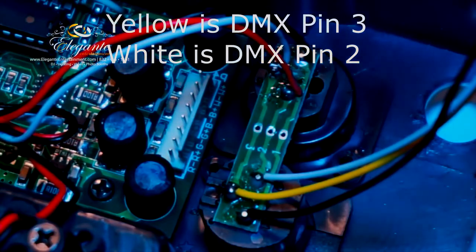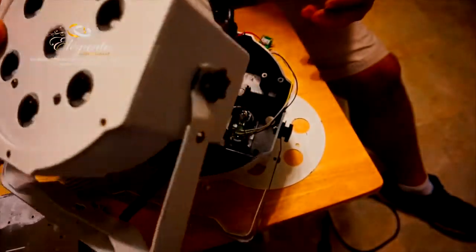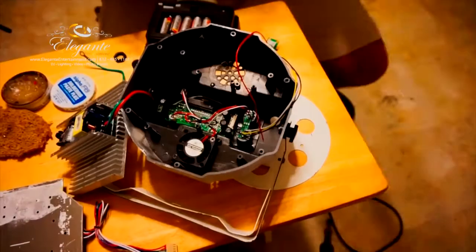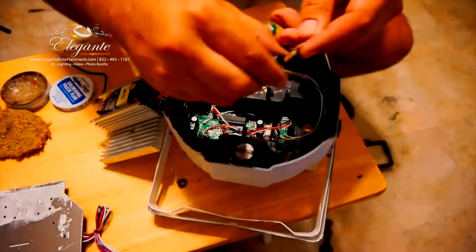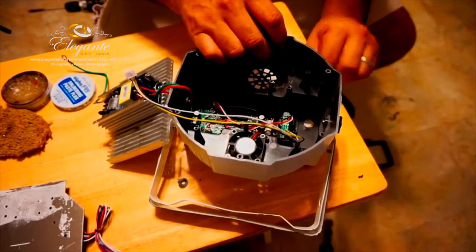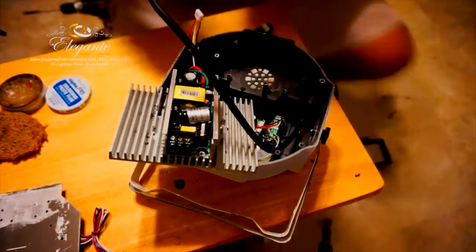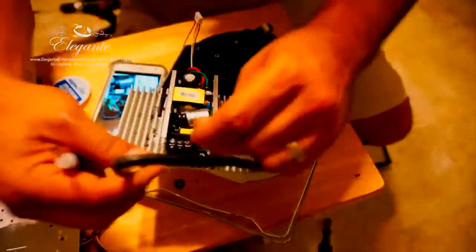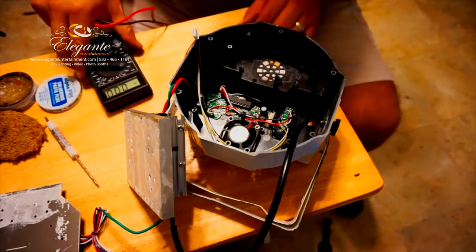As you can see it's a pretty good solder job - I put in enough paste. Now we're going to drill the hole. We figure out where the hole goes on the light - all four of them are the same. On one side we have the wireless antenna, on the other side we have the power cable sticking out. I'm going to drill a half-inch hole where I can put in the plastic holders, then set the power cable through that holder with enough slack to reach the power supply and plug in the three cables, plus the ground cable that goes to the top of the board.